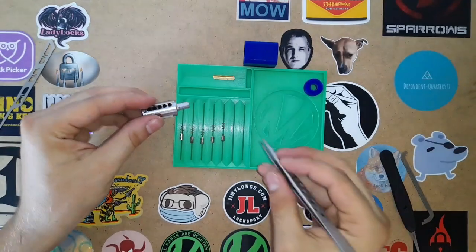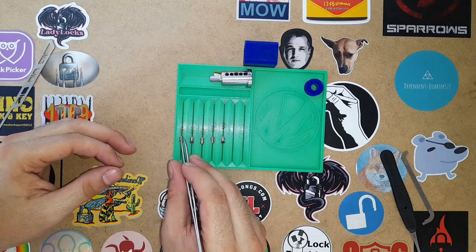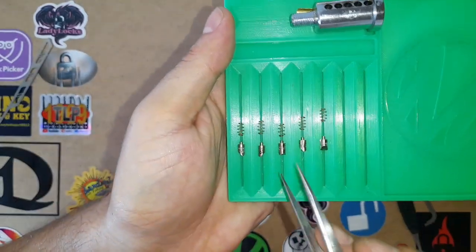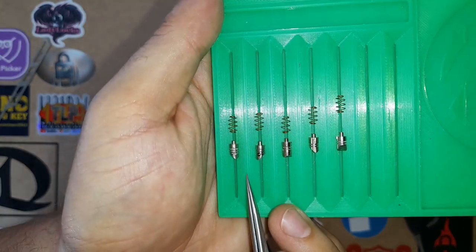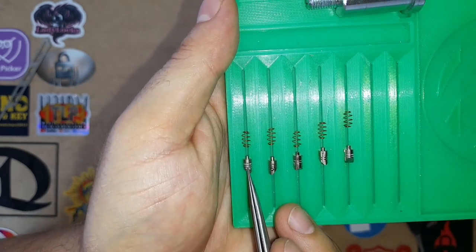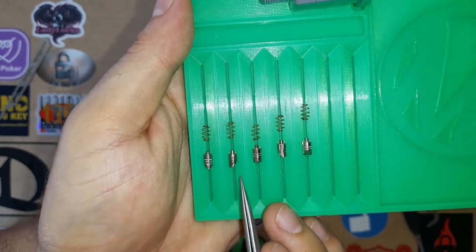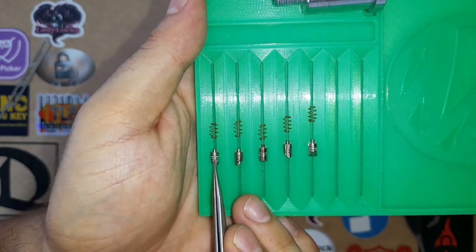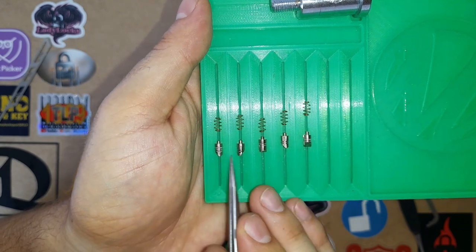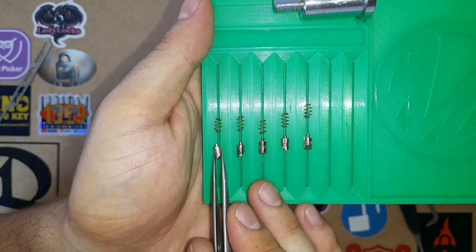Here is exactly how it works. Yeah, and yeah, the pins have different combinations, because this one is called biaxial, and the reason is, let's take a look at first of the two pins. As you can see, one is angled to this side, the other is angled to this side, but they both have the hole on the front, so there are six possible combinations of rotation of the pin. So neutral, 20 degrees front and 20 degrees back, times two, because there are two types of pins. That means six combinations, excluding the different heights in which the pins could be set.